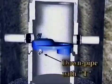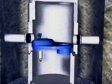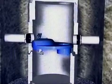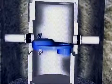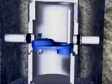The 6 to 12-inch PVC downpipe has a plastic T on one end; dimensions will follow shop design plans. Install the downpipe by coating the outside pipe end with PVC primer, then PVC cement, and push the pipe into the coupling located on the underside of the weir. This installed section is either 16 or 44 inches long, depending upon the Storm Scepter's unit size. The T must be oriented parallel to the wall of the storage tank — this alignment will allow stormwater to flow in both directions along the sides of the tank and not directly into the wall.